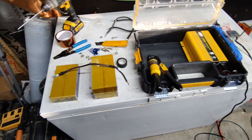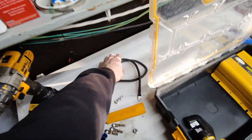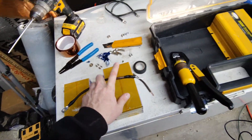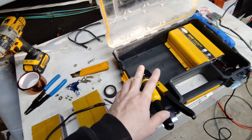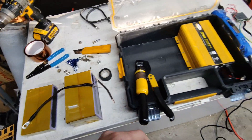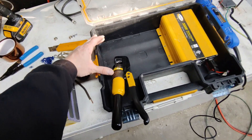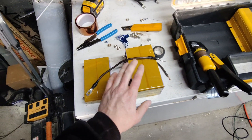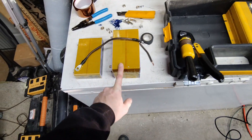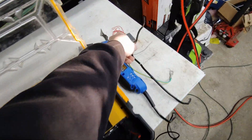I've moved on to making some cables. These cables are extremely overkill - six gauge is not needed, so I'm moving to eight gauge. It's only going to be for 300 watts, two chargers, so eight gauge will be plenty. The batteries are going to be double stacked here and one here - I'm still configuring. Two tall can fit but three tall cannot, so I'm just mocking up my wires and hooking up my BMS, which is a 35 amp BMS.